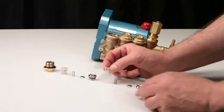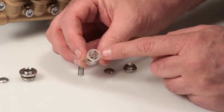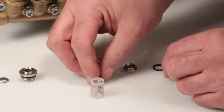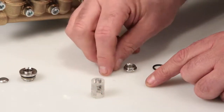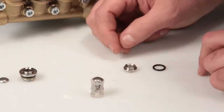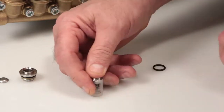To reassemble the valve assembly, begin with the inlet spring retainer. You will notice that one side has guides for the spring. Place on a flat surface with the spring guides facing up. Insert the spring, ensuring that it's in line with the guides, followed by the valve with the concave side down. Position the inlet valve seat onto the retainer and press into place.